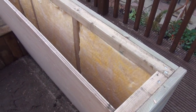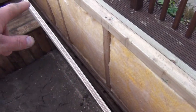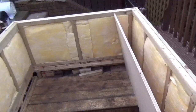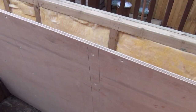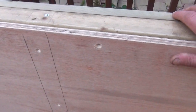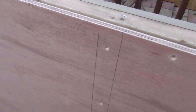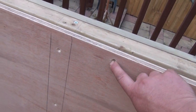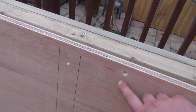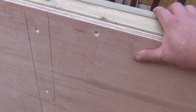This is just a quick detail of the last stage we did, which was to put insulation in here all the way around. The next stage is to put some hardwood plywood on the inside — that's a lovely smooth surface for the liner. It's going to be screwed on and all these screws are going to be countersunk so there's no rough edges, nothing to snag the underlay or the liner.